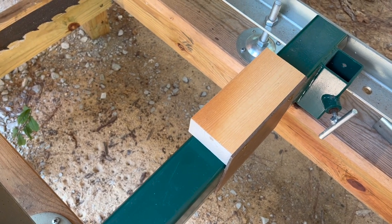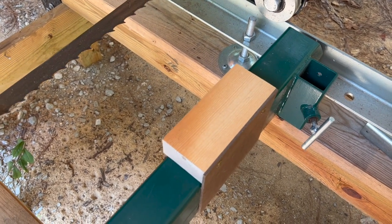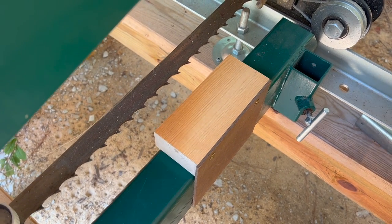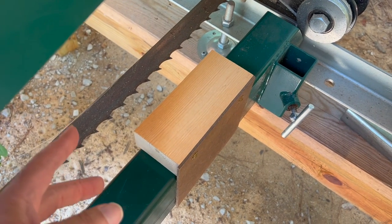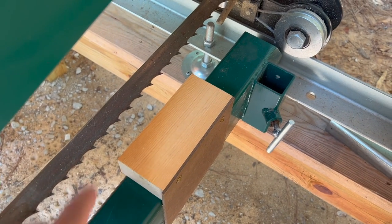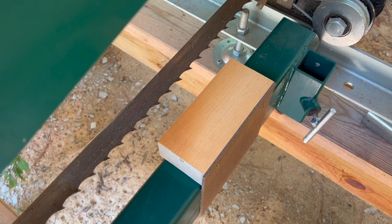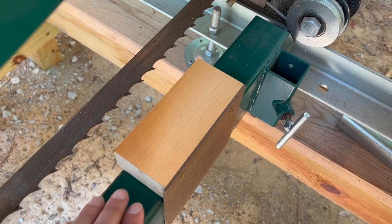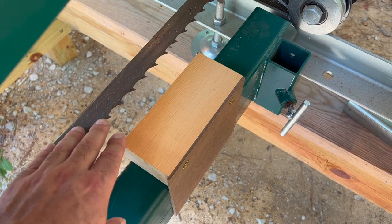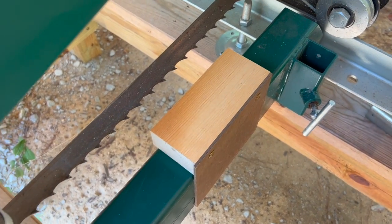That's been very carefully sanded to exactly 1.5 inches. And then I just ran the blade up and adjusted the height of the saw head until the bottom tooth, because saw blade teeth are set up and down alternating. There's usually one in the middle, then one up, one down, or some variation like that. And it's the tooth pointing down which sets the height of the wood that's left off of the bunk after the blade passes through. And so I set the height so that bottom tooth was just grazing this calibration block.